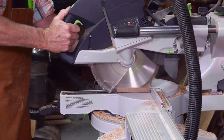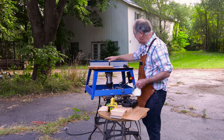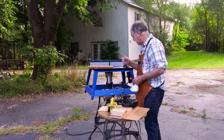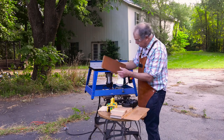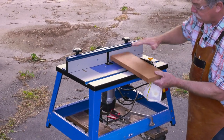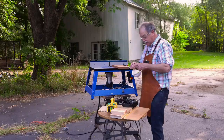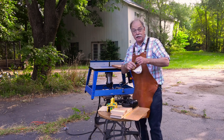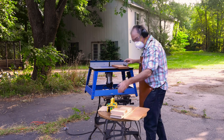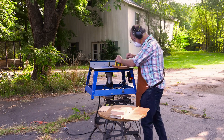Then it's out to the router table. We're outside to do all the routing because even with dust collection on a good router table like this — a bench top model I like with a two-horsepower router — there's a lot of dust. Spiral upcut, three-eighths inch bit, solid carbide. I've selected the best faces up. I'm using a miter gauge to do the short grain or end cuts first. Mahogany, or any wood that's resistant to decay, means you definitely want to be wearing an N95 dust mask, even with dust collection. I use an excellent push block to hold it down to the table and against the fence.